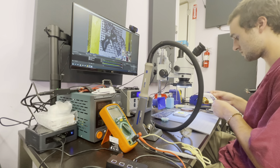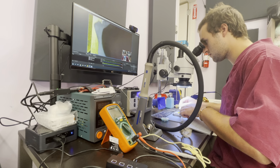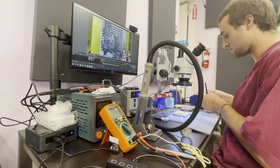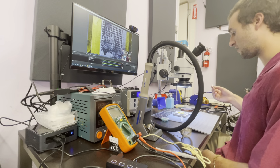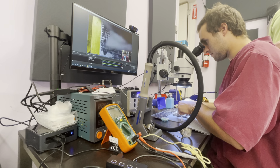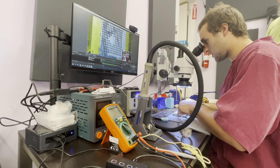Right. Because once you take that off with that, oh, no shit. That's not magnetic. It's all the stencil. It's all the stencil that's going on through. Wow. Actually, while we're here, this is all heat resistant phenolic stuff. It's not going to melt or anything. Absolutely. Did you put this in alcohol first? No. Just wipe it straight dry. Okay. Yeah, and not that much pressure, just enough to lift everything off of it, because you don't want to push down into the stencil.